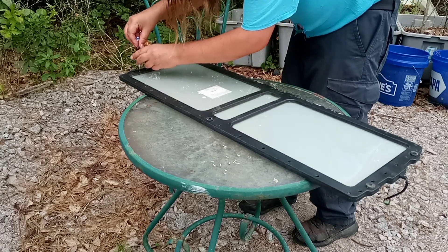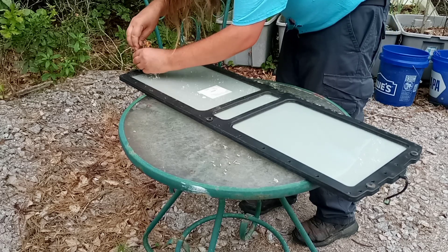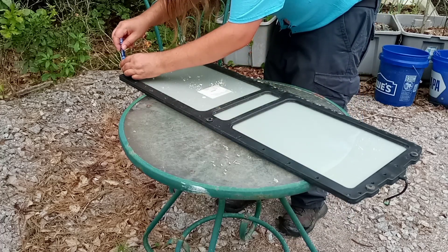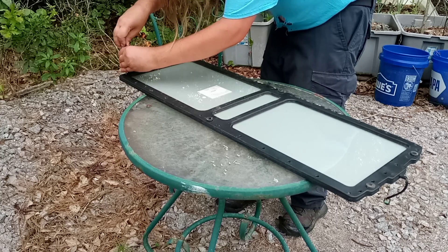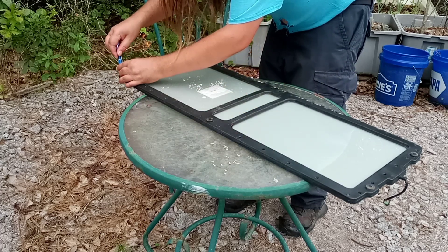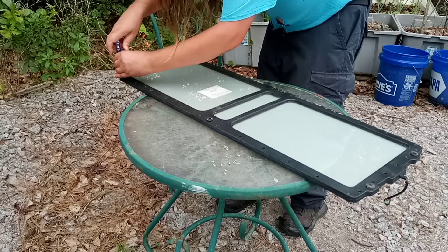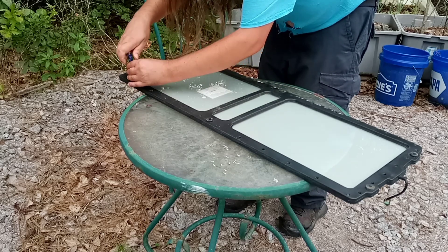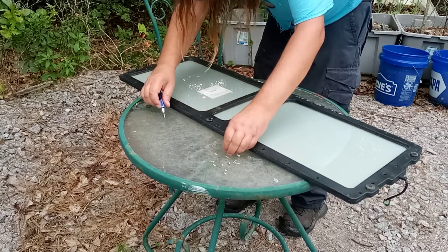So I'm not really surprised that this panel has failed. I put my meter on it just before I started filming and I got no volts out of it — there's a surprise. It was giving me about three volts from around six months ago, which is when I took it out of circulation — it was burning up more power than it was producing.